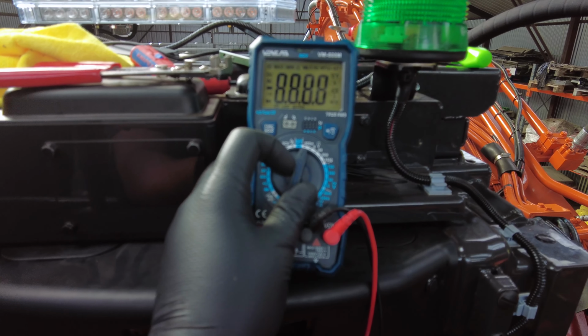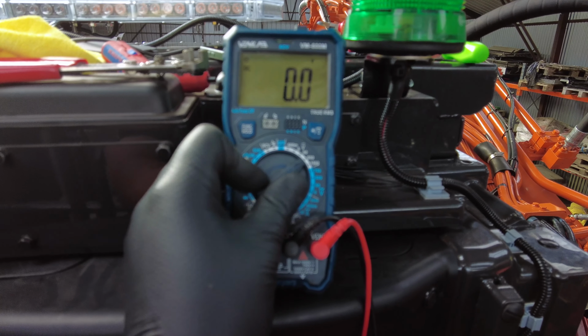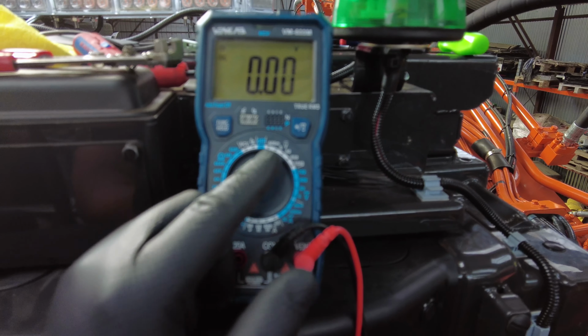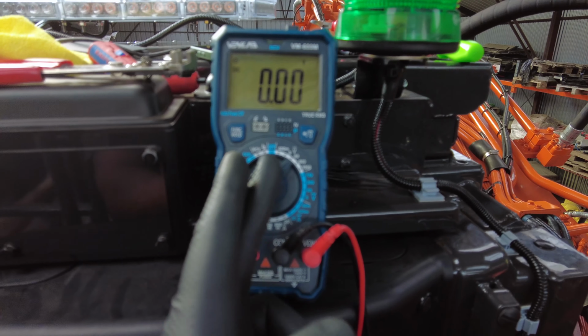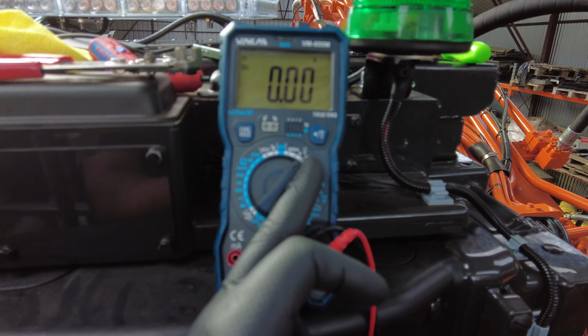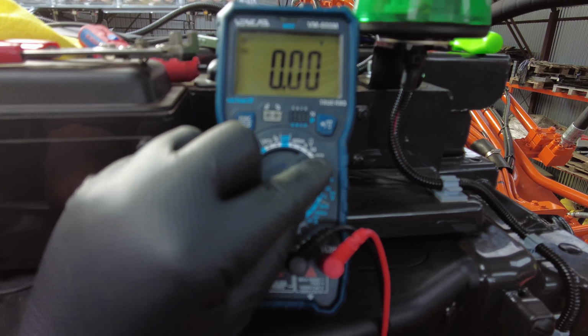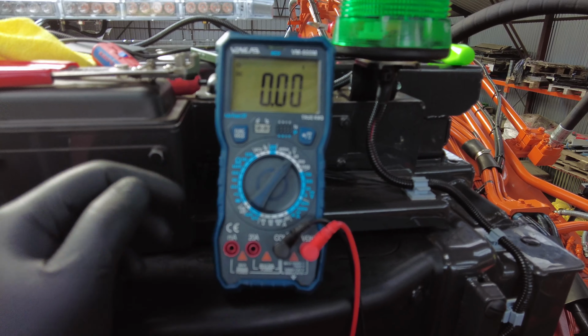We're going to click it along. That's 600 millivolts, that's 6 volts, and that's 60 volts. We're testing from a range from 0 to, this will be 24 volts, so we need to be in between the 6 and the 60. 6 is too low to read with it being a 24 volt. The 60 is high enough so we'll get a range.